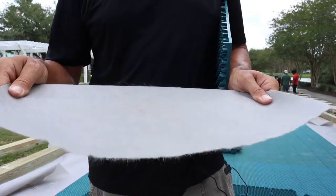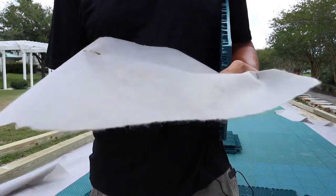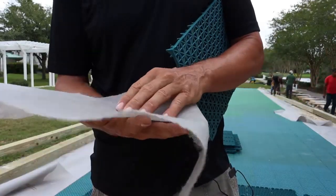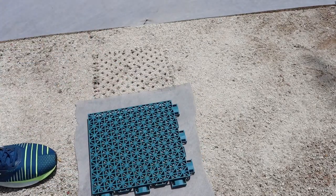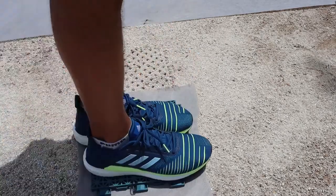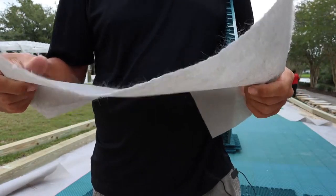But when you stretch it over your bowl and wrap it tightly and create that tension, what it's doing is, if you add any weight to the center, in order for that fabric, or Saran wrap, or in this case the weed fabric, to depress, it has to pull from the outsides. And when you've got it locked in from the sides, it doesn't really want to push down into your base material, because it has to pull from the side. So we've created no slack.